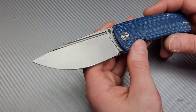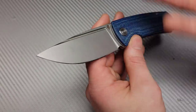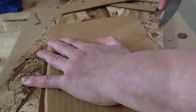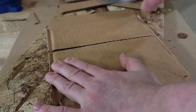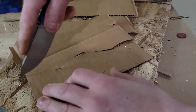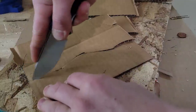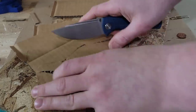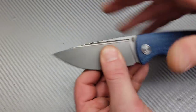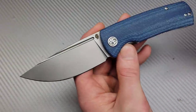The sharpening choil looks great — the plunge grind is well separated, so you have plenty of blade to reprofile. For utility cuts, there's no problem. You're going to lose a little leverage since the choil placement puts you in a middle spot — not maximum leverage, but not all the way out either. There's lots of belly on this knife, but the tip does drop down quite a bit, which is more than it seems because of the fuller.